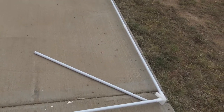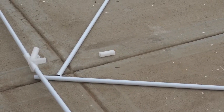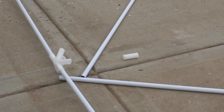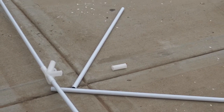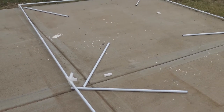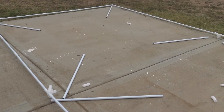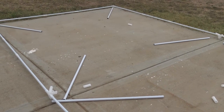We've laid out the number three roof supports — those are the first ones that go into the plastic corners for the roof. You're definitely going to need one to two extra people: one person to hold the post and one to assemble the roof. Otherwise, you're going to have issues with cracking, bending, and problems with the frame.